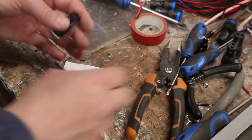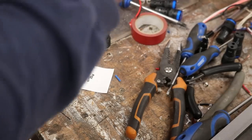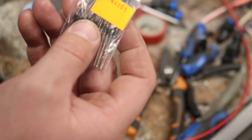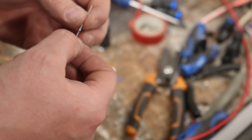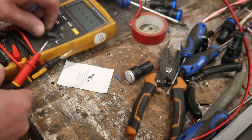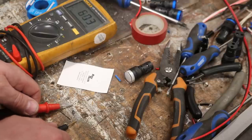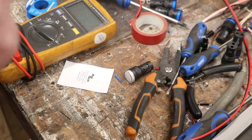If I zoom down on my very messy workbench — I've got the specs on, you see — I'm going to pop in a little 1N4001 diode. So we're going to pop one of these diodes in there. First things first I want to just check the polarity of it — we'll pop it on the table, bring in the meter and put red there. That's closed. So in order for the current to flow forwards we want to have the little white section on the diode pointing at the LED that we want to switch.